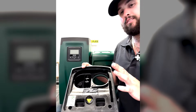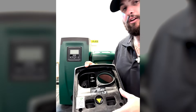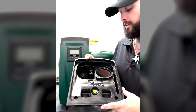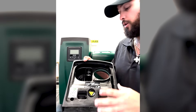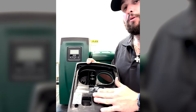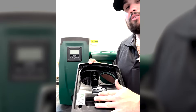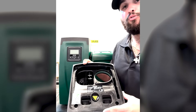That port is the motor shaft to the actual pump itself — that's why we put a lightning bolt there. One, you might get electrocuted, but two, it will completely rust out the shaft of the pump itself. So please do not prime the pump or remove that cap unless you've spoken to technical support and they've advised you to check and see if the shaft moves freely.